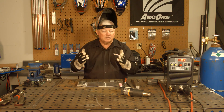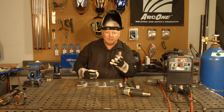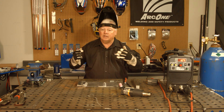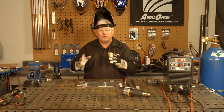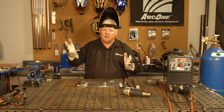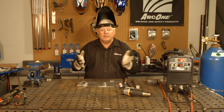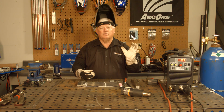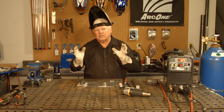When you get into heavy industry and guys start preheating with oxy-acetylene rigs and big rosebuds, you want to make sure that you never preheat above 300 degrees Fahrenheit. You do start changing the properties of the aluminum — you start the aging process and all kinds of things. I only preheated to 125 here, that's all I needed. A good rule of thumb: if you have heavy industrial stuff, preheat to 200 degrees — that gives you a safety margin and you're not going to create any annealing effects.